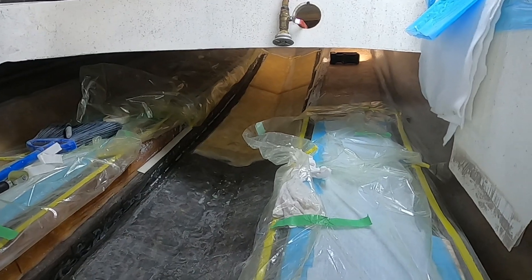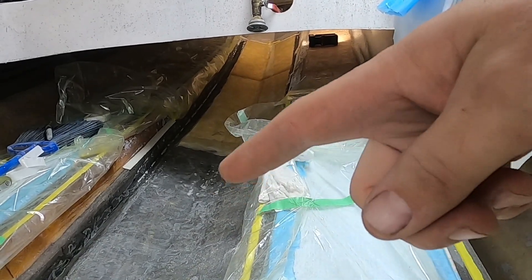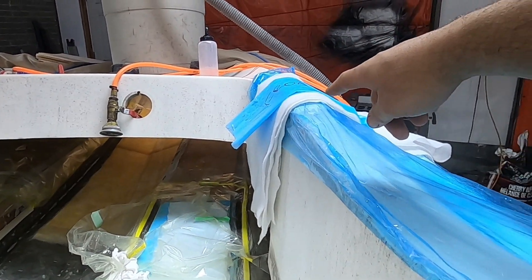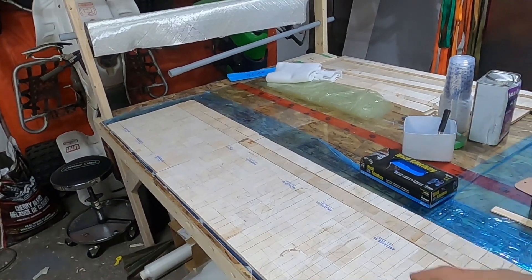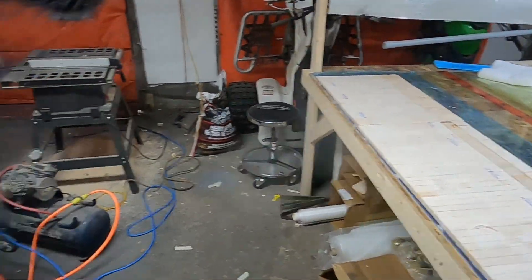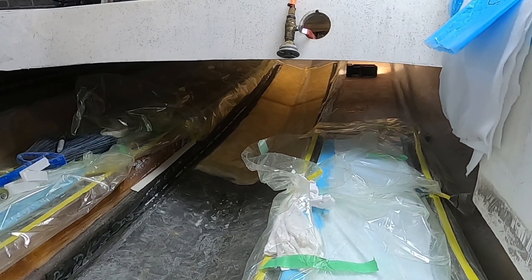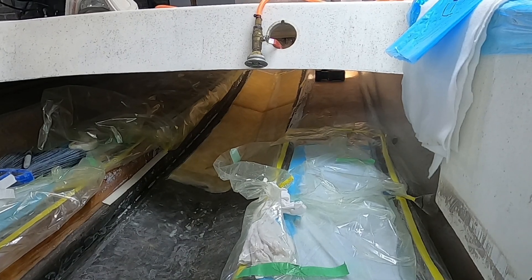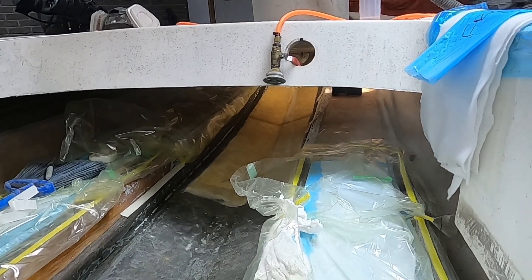Got my bag set up on the left under the bow. Did a bit of grinding on the epoxy I put down the other day and cleaned it all up. The bags in, I've pre-cut all my material — release film and breather — got my balsa here, so I'll pre-wet this and dump all the epoxy into a cup, mix it up with cabosil to make the adhesive, then crawl in there, lay it all out, get it bagged, and hope it works. Yes, I'm adding core over top of core mat — probably not the way to do it, and I'm sure I'll catch grief for it, but I don't care.